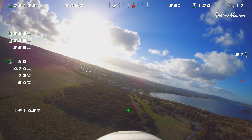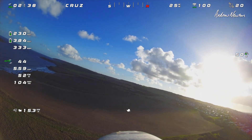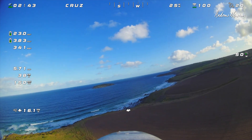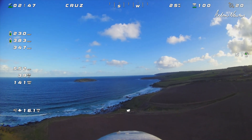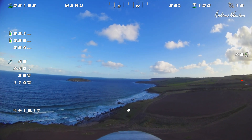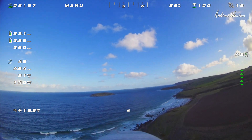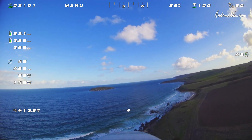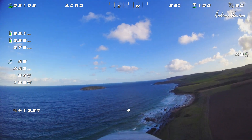The current during the launch got up to about 17-18 amps, which is a bit of a stress for the 18650s — they're rated at 15 amps, so it can handle it and can certainly fly along at 10 amps pretty happily. About 4-5 amps was the cruise current. Testing in manual now just to see that my throws aren't too ridiculous, and they're all very good — even though they're quite large throws, it seems to be appropriate for this plane.